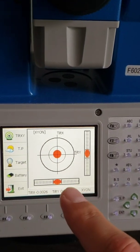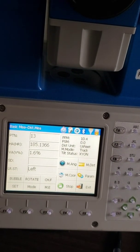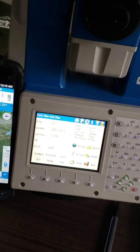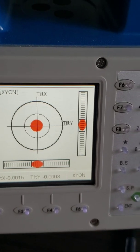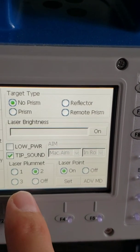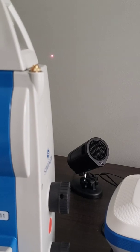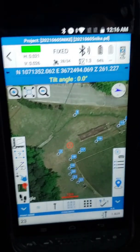What I'm showing right now is how you set this up — you get your tilts correct, then you can come back in and get your horizontal and vertical angles. Your vertical angle changes when you tilt the instrument, and your horizontal angle changes when you rotate and spin it. You can change which type of target you're shooting — whether you're shooting the side of a building or a prism. You can adjust your target type, use the laser plummet to see if you're still on top of your nail, and turn your laser pointer on and off. You can interact with the R80 through this interface on both sides, as it's double-sided, or interact with it via the controller.